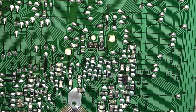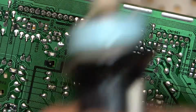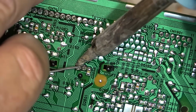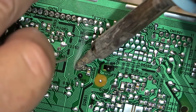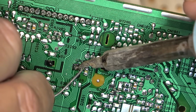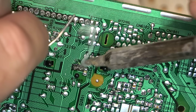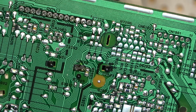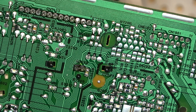See, how they work is, on this chassis anyway, how this one works is it uses that record lockout switch. When you push the tape in, that gives it the signal to go, to load. When it ejects, it's watching for the end sensor to show light, so it knows that the tape has been lifted and it wasn't getting that signal.